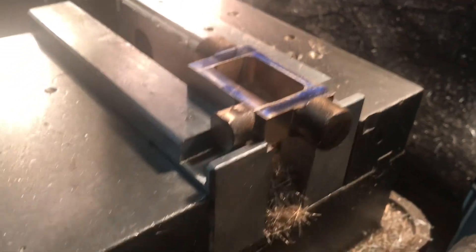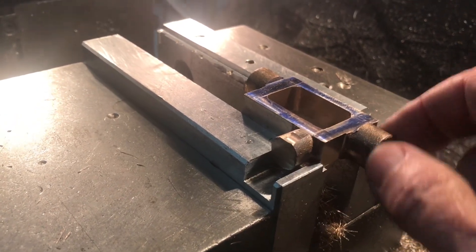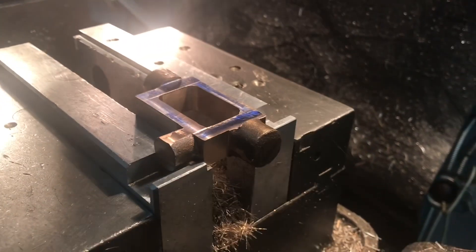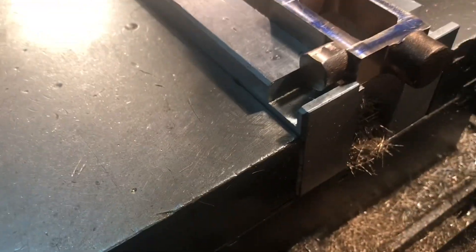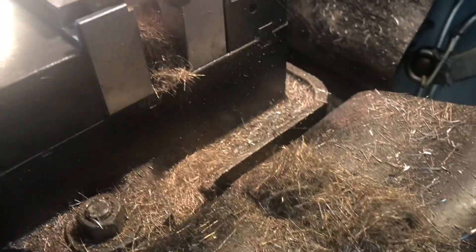I might as well drill those holes while I can. The remaining things for these will be turning the bosses to size, drilling and tapping for the steam inlet, and drilling and tapping the back one for the valve guide. One thing I did want to point out — when you're using the side of an end mill, it creates a lot of needle-like shavings. This is bronze, so it's kind of a shame to waste it, but be real careful with it — it's like needles, it'll poke you. You definitely don't want to use an air hose to blast it out into the atmosphere. Either sweep it up, scoop it up, or vacuum it up to contain it.